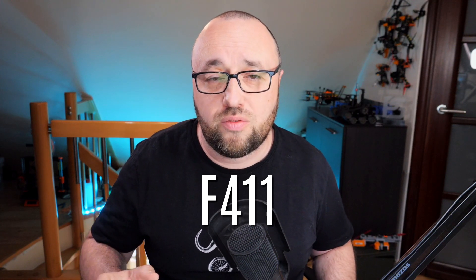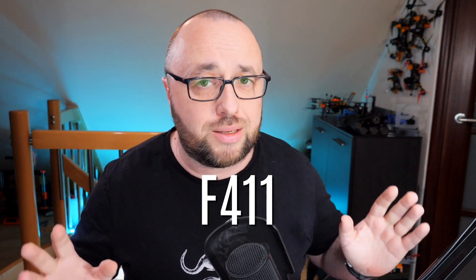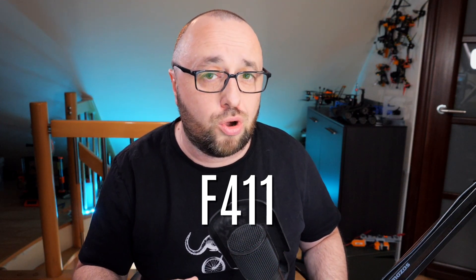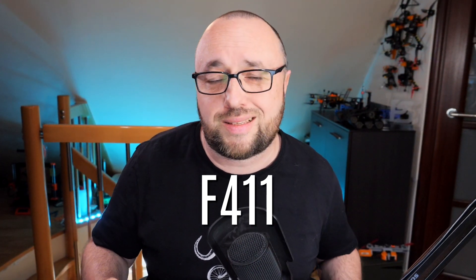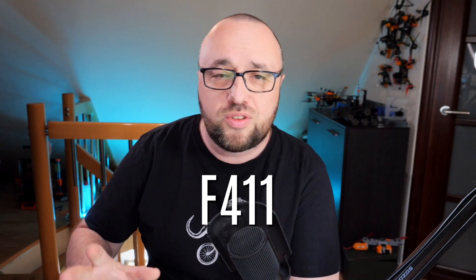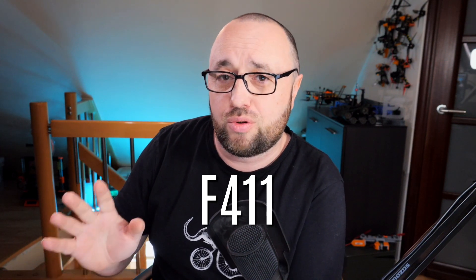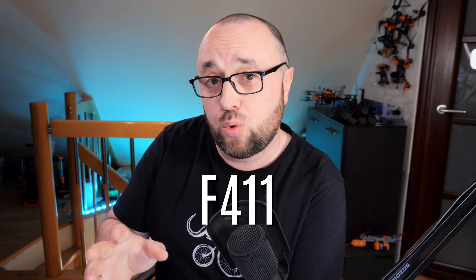The situation with F411s is not so straightforward. If you don't have to connect SBUS or SmartPort, it's all great. But F411s have very little flash, very little memory, very little serial ports, and connecting everything you might want to connect to an F411 can be a challenge. This is why they work fantastic on tiny whoops, toothpick-style drones, or very small airplanes where you don't have to connect a lot of sensors. But with bigger and more advanced builds there will be problems. Unless you're building something very small without many peripherals, just ignore the F411 and go with something more advanced like the F405 or other families we'll discuss in a moment.